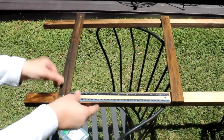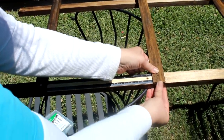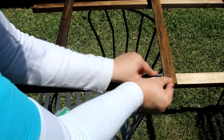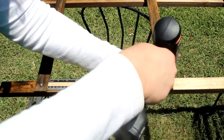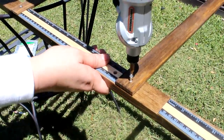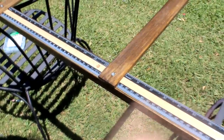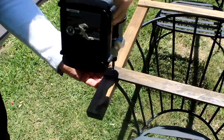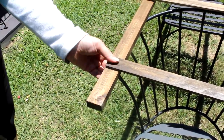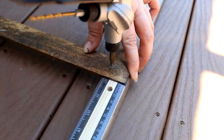Back to ladder construction. To attach my next cross piece I'm going to place my ruler on the ladder and take another machine cut edge — it always needs to be the machine cut edge on this side because this is how you get everything level and straight. I place the ruler on the pine board and then place the machine cut edge again, lining it up with the edge of the board. So it's one ruler length in between and then that machine cut edge goes right up against the edge of the board. On the other side I measure down from the top exactly four inches, make my white line, attach that first piece right at that white line, flush with the side of the pine board.